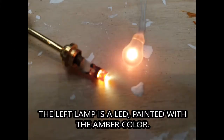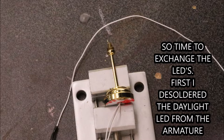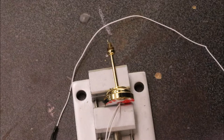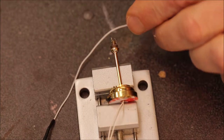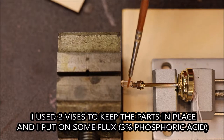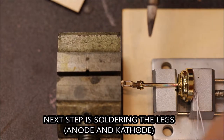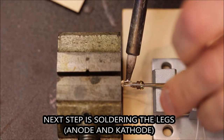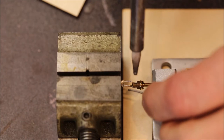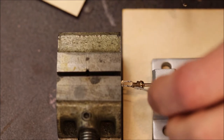As you can see it was a bit better but it was still not what it should be. So I decided to exchange the LED and I ordered more warm light LEDs, 3mm. I cut off the blue LED and soldered the new LED. Of course I cut the wires to length, added a bit of flux, and then soldered the leads together. I held the LED and the armature in place with two little vices because it is impossible to solder otherwise.